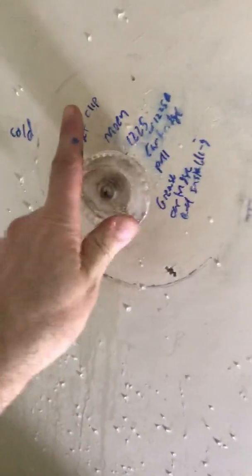You can test it before you put on the flange — just tighten up the screw and see if it's correct before you put that flange back on, it'll save you a little time. Right now cold is coming out, that's what I want. This side is hot. Now just take that screw off and don't move the knob.